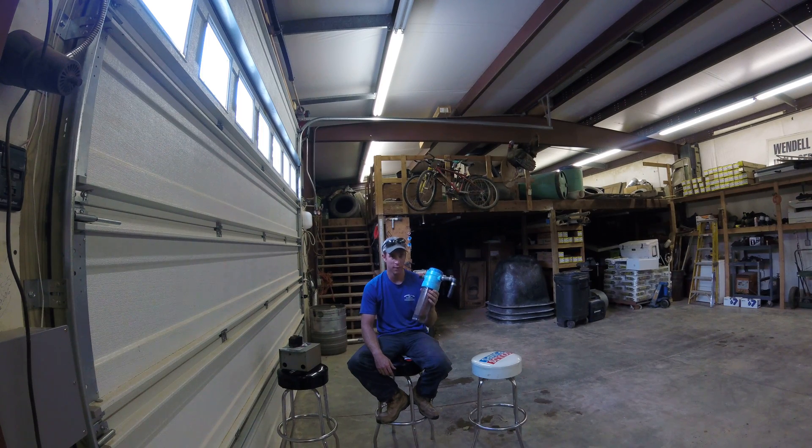First, check and see if you have a filter. Most people know they have a filter and have been changing their filters. But some people buy a house, haven't been in it long, and either aren't aware of a filter or the filter is way up under the house. It's a quick and easy thing — determine if there is a filter, and if there is, most of them have a clear bowl so you can do a visual glance and see if the filter is stopped up. If it doesn't have a clear bowl, you can unscrew the bowl and look at the filter itself.